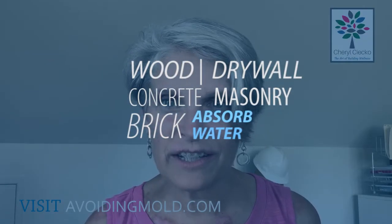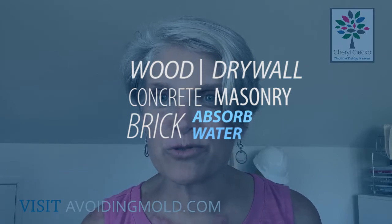Many of our building materials are porous, meaning they absorb water — wood, concrete, brick, and masonry all absorb water. So they will be soaking in the water. You might clean the surface with bleach, but the bleach is now evaporating. It's actually very toxic for human beings to be breathing, and it does nothing to the mold in the air. The mold spores flying around in a panic now have lots of wet places to land, and the roots of the mold that might have been removed on the surface are getting a great big drink of water.